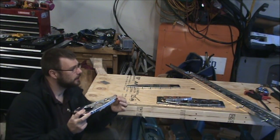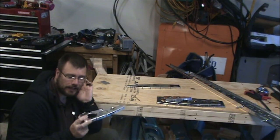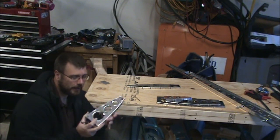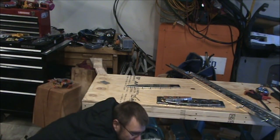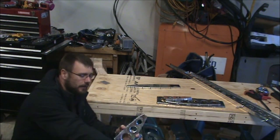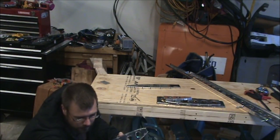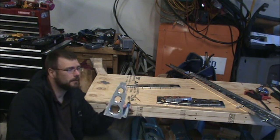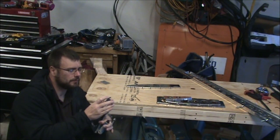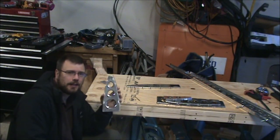And I could have sworn it was something that was fixed, but when I put the skin on, I ended up with just a real slight dimple or dent on the midrib and the top one as well. Well, and maybe a little bit down at the bottom. So it seems like I probably should have rounded these, but I didn't think it was necessary any longer. I thought maybe that had been fixed. I could have sworn I also read somewhere that it only happens if you attach the skin to one side completely and then try to fold the other side in. If you follow the instructions in the manual exactly, if you attach evenly from the nose back, you don't run into that problem.